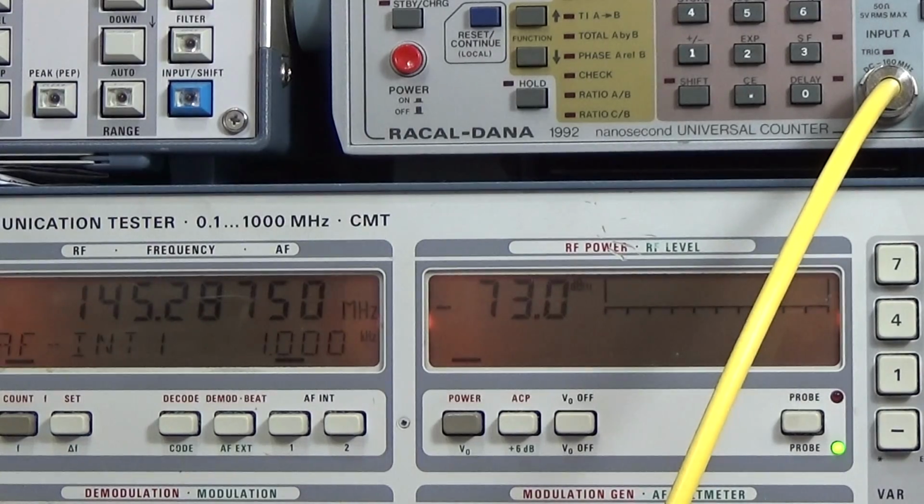Okay, now just to show you that the ALC is now really working fine, we have to adjust it to 2.5 watt according to our specifications. And when I go on transmit, you see I can really adjust it with the pot for ALC adjustment, and our radio should be outputting 2.5 watt. I'm just talking, so that makes it not easier, but you see it is working. And that is really the proof that it is now back working. Everything is really fine.